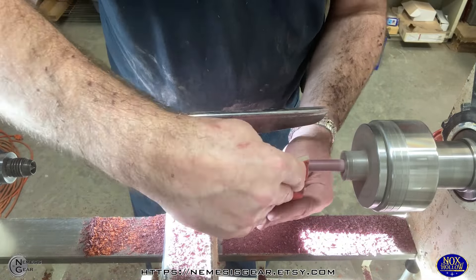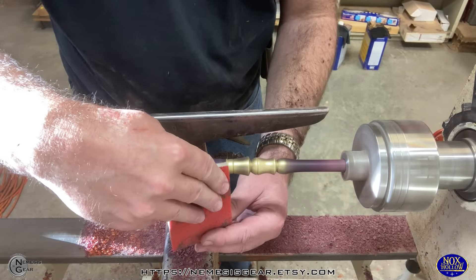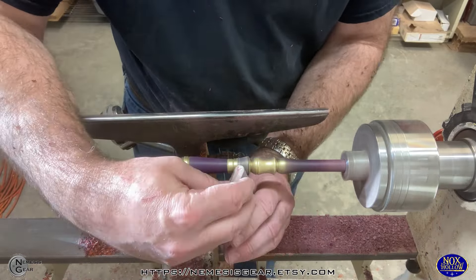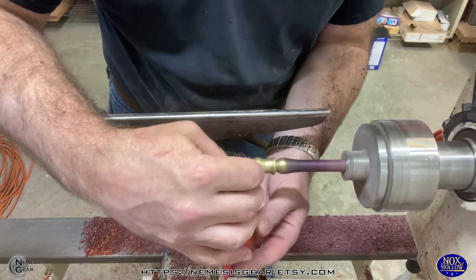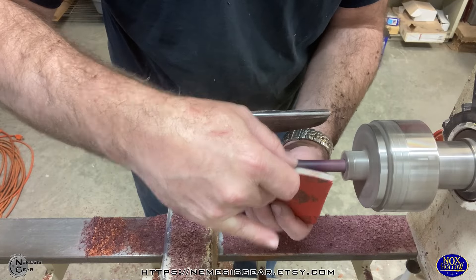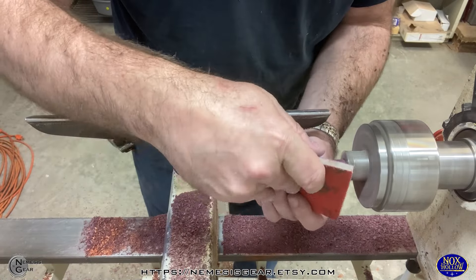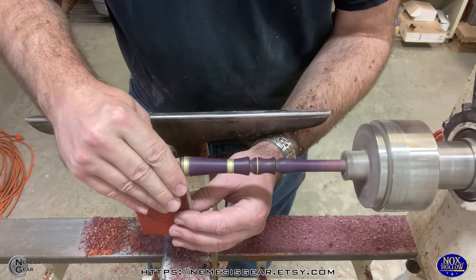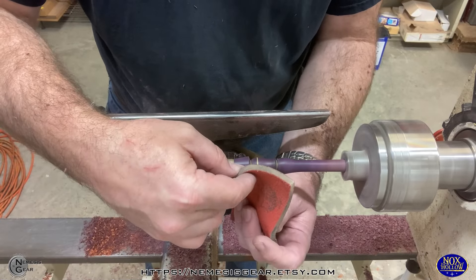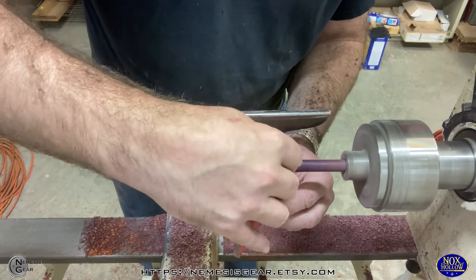I just finished up a basic sand on this. I take this to about 320 grit or so. And then what I did is I took this down to the spray booth and I sprayed some gold paint down across the handle, with the intention of really trying to concentrate it into those friction burns. The idea is that once I get the sanding done on this, down inside those grooves that I put in there, that gold is going to stay in there. I don't paint terribly often on these because the paint sits on the surface and it can wear off. But when you do it down inside recesses like that, it can't get rubbed off easily. That's what I'm trying to do with this.